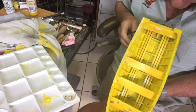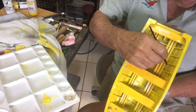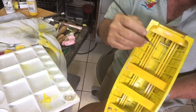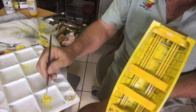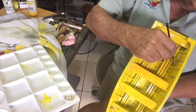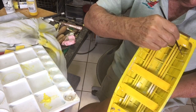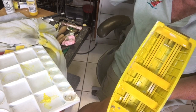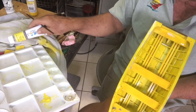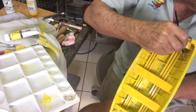One of the interesting problems I'm having is that now that I've painted yellow, where there are spaces between the planks and the ribs with these little tiny holes, they're showing up very dark. I'm speaking to Martin Superville, who is actually going to be the person getting this boat and who is an artist. His suggestion was to use full acrylic paint — yellow preferably — to fill the little cracks, and I have to say it's doing a marvelous job.